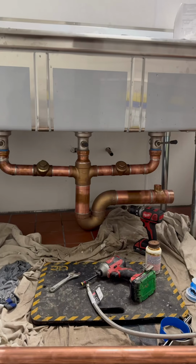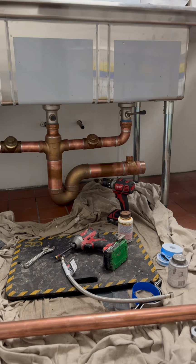All right, it's noon. This is where we're at so far. I don't have the faucet, or else I would have mounted the faucet. I'm not sure if I can even make the last connection on the vent, because then I don't know if I can get the sink off the wall. But we got the drain all in, clean outs across, 2-inch into 3-inch.